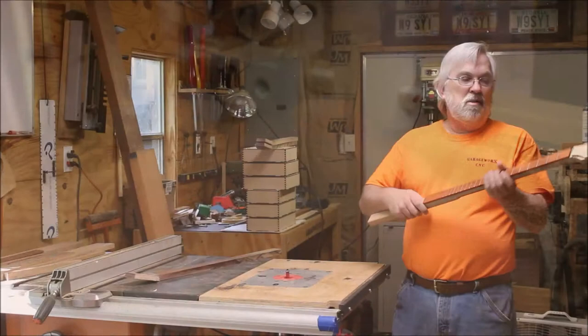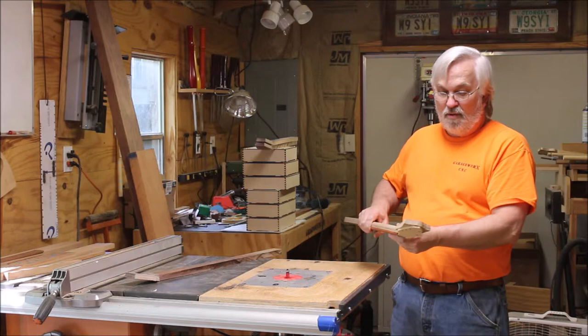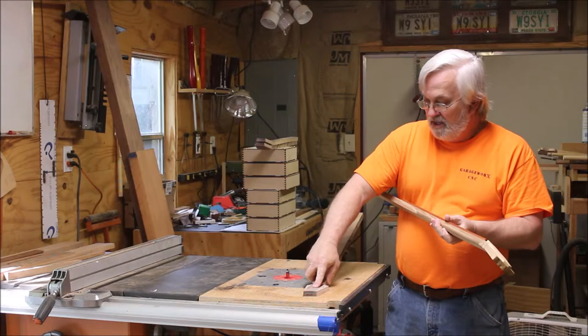As I mentioned earlier, on the CNC I had to put that quarter-inch MDF spacer under the pre-fretted neck. Same thing here when I'm using my 3/8ths flush trim bit — I've used double-sided tape to put a spacer on there to hold it flat and keep it off the edge of the fretboard. When I get done with this one, I'll have to lower the router table back down for the other three, since there's no fretboard on them I can do those without the spacer. It's much easier.